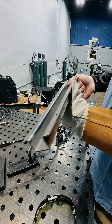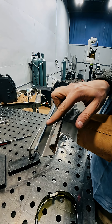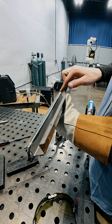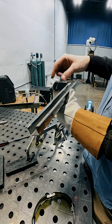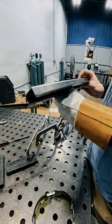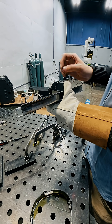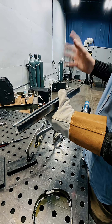And you can see it on the back. Oh yeah. I went a little slow right there so you can see that the heat built up. And then there was another snag. That's the cool thing about it — you can see why, what happened from the weld, from the backside. That's pretty interesting. If this was TIG, it'd be a lot bigger, thicker, and it wouldn't be as easy to read.